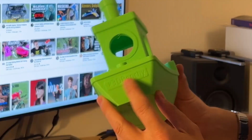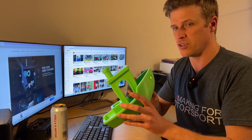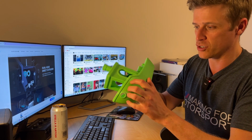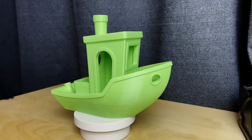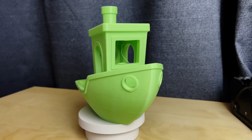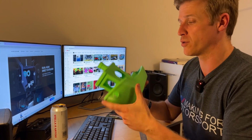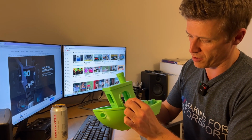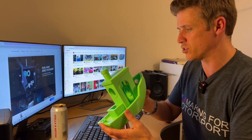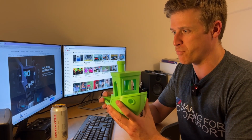I mean, the 3D Benchy on the back is perfectly clear, but there's some big challenges with this when you scale it up, and that's things like the archways become more of a challenge, some of the overhangs, and the bridging. I mean, look at the top of this window here. This bridging, it's 4 centimeters worth of bridging on a completely untuned printer. There's a couple of loose bits of filament, but nothing that a little bit of touch up wouldn't fix. But look at the size of it. This is now my prized possession.